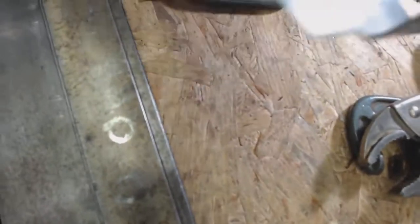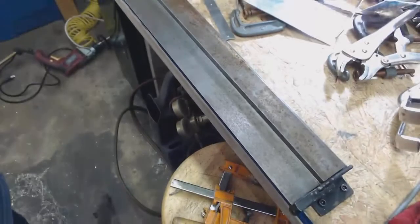What actually has to happen is that the bend bar has to be basically there — there's that material thickness gap in between the bend bar. Like that right there, because you have to account for that material thickness. Tell me if I'm thinking wrong, guys, but it's pretty damn accurate.